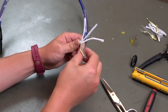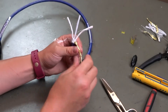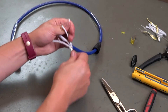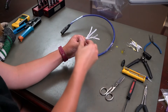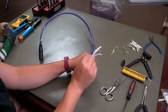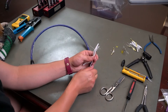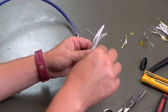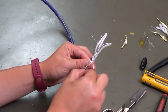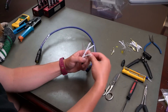This is me filling time while I just cut off the multitudes of metal and plastic that surround these. This twisting motion is really helpful — it really loosens it up. What I generally do is take a little razor blade to the edges, but that's because I have very skilled hands at this point. You don't really want to do that, especially if you're only doing one, because you can cut the wires. The most time-consuming part of terminating the SuperCat Sound cable is removing all of the junk that makes it a durable cable.